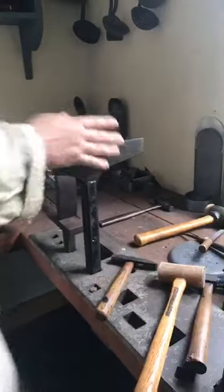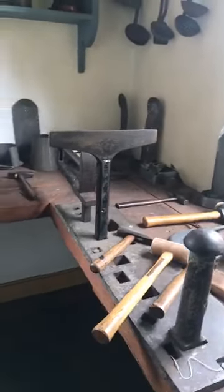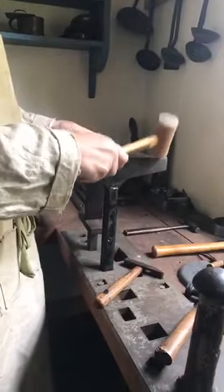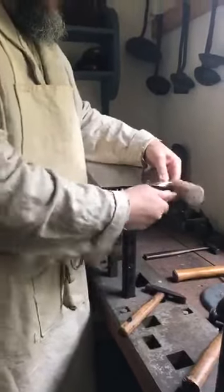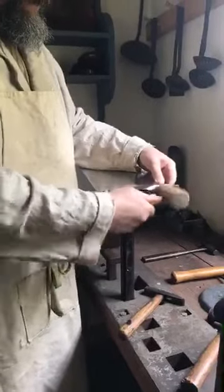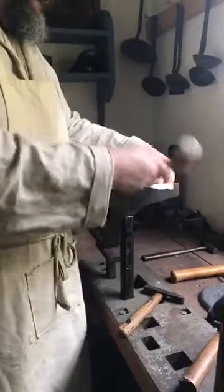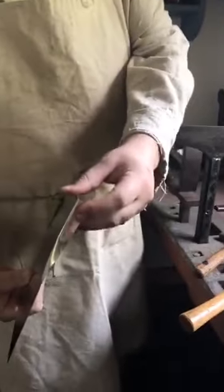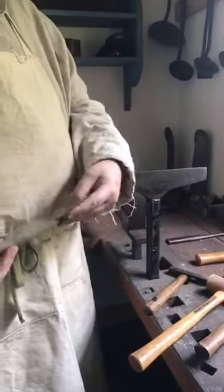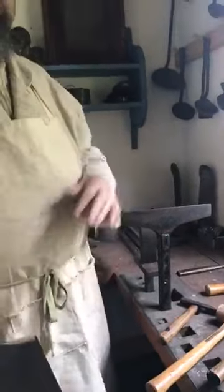Roofing point, this one, this is called a hatchet stake. It's actually used for forming metal over. When I take a piece, and actually begin to hold it and bend it into place, that's how I start to make a 90-degree bend. And when the original first started tinsmithing shop, that's how they did it. Eventually, through the Industrial Revolution, we came up with these machines.